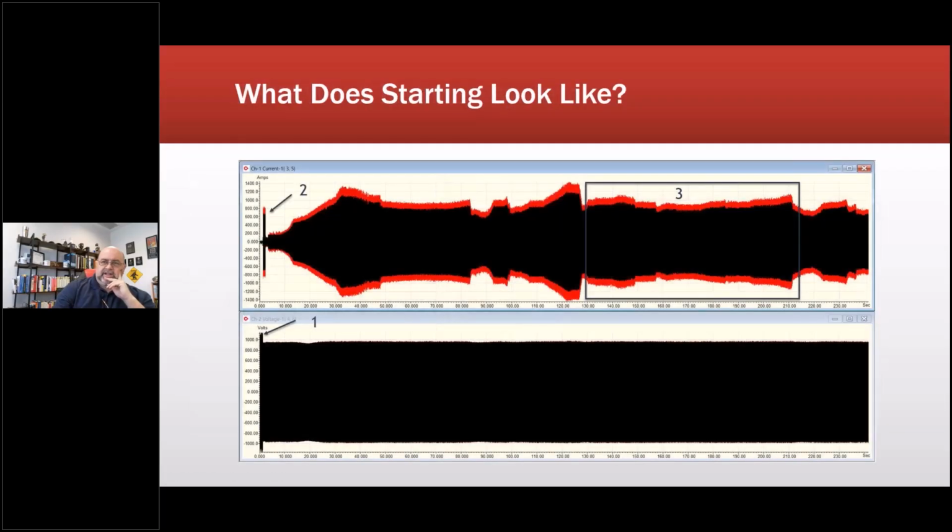And we went in and the first thing we did was inrush studies to see what starting looks like. We've done other inrush studies on other towers; this one I used for an IEEE paper. They're supposed to have a soft start, but what really ends up happening is a circuit breaker closes, and the entire system, which is turning at full speed, sees full torque for the first 1 to 2 seconds, which is definitely an issue for some of the mechanical systems, and then it all kind of evens out.